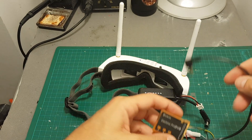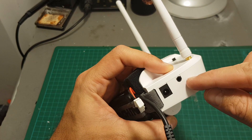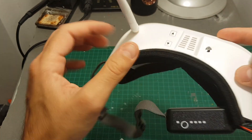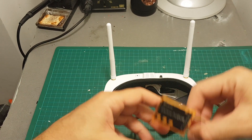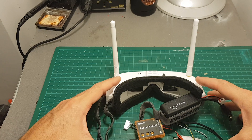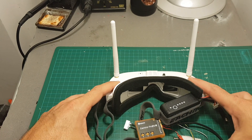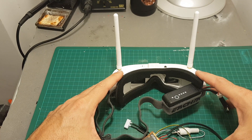If you want to output the DVR video to the goggles, you'll need another 3.5mm connector for this port. Because there is only one connector that acts as both video in and video out, you won't be able to do both simultaneously — you'll have to switch it and enter AV-in mode by long-pressing the button over here. I'm still testing the goggles and I'm going to use this mode to compare the receiver with my FatShark goggles. I'll release the full review soon once I have more experience. As always, thanks for watching, hope you find it useful — don't forget to subscribe, and see you in my next video!